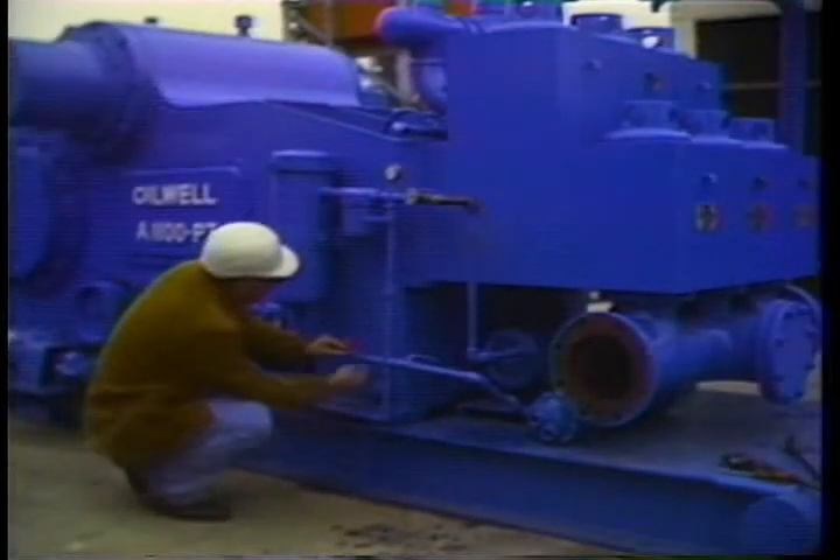If your pump's diaphragm housing, which holds the rod wiper rings, is equipped with grease fittings, you need to grease it every day. Always keep an eye on the oil pipes for leaks.